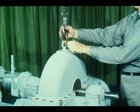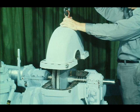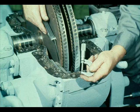After the cap screws have been removed, the workman fastens a shackle to the eye bolt in the casing cover. Remember, this eye bolt is to be used only to remove the cover, not to lift the entire turbine. He then lifts the casing cover very slowly, checking frequently to be sure it is not coming in contact with the rotating assembly inside. The cover must be lifted straight up when removed. After you have cleared the top of the wheels, set the cover to one side.